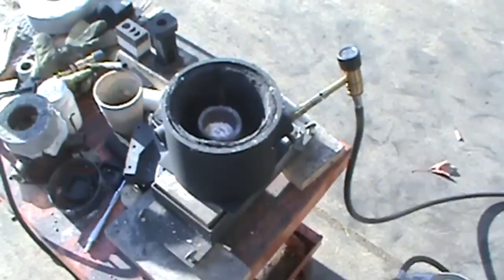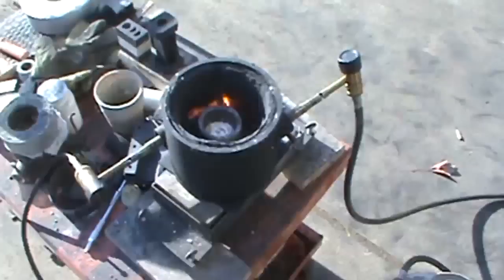I'm going to do a video today on a different style of furnace. Since I started making the micro minis and the fives and the sixes, people ask me why I don't do the vortex heat system inside instead of a convergent. The convergent works good and it works fast, but with time on my hands this week I went ahead and built a furnace that's going to use the vortex flow of gas, where it will go around the crucible instead.